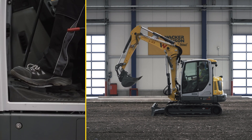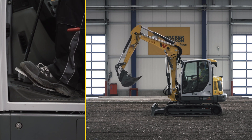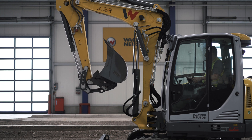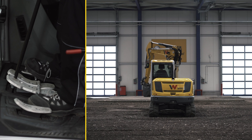The pedal on the left side of the footwell is used to extend the triple boom. Please make sure that the shovel does not damage the boom — this may occur if all cylinders are completely retracted. The boom can be swiveled using the right pedal in the footwell.